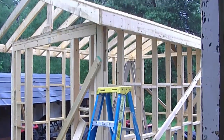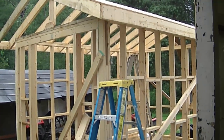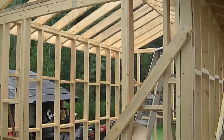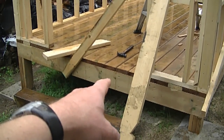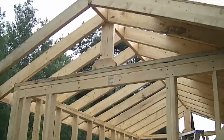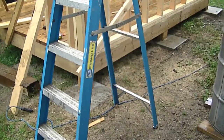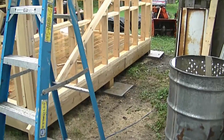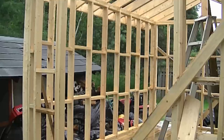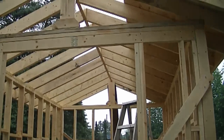I've also been busy this summer building a shed with a friend of mine. He's older and knows what to do, so he's showing me how. This has taken a lot more of my time than I thought — it's a much bigger job than I realized. It's going to be a 12x8 shed for storage, with a 48-inch door at the front. The base is made out of 2x8s, the top out of 2x6s — pressure-treated wood for the base and regular spruce for the frame. I've got part of the sheeting on for the roof and still need shingles and tar paper. It's sitting on deck blocks over crushed stone, and it's under 100 square feet so I didn't need a permit. Once it's done I'll make a video showing how I've organized the inside.